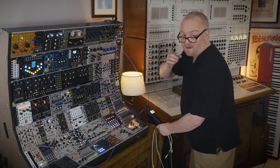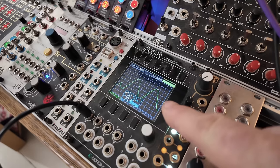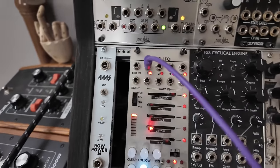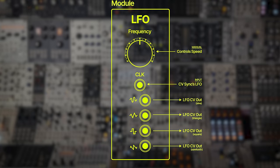We've plugged that into the speakers just like we had with the other oscillator, but you'll see that it's going incredibly slowly — too slow for us to hear. So this oscillator is actually called an LFO, which stands for Low Frequency Oscillator. It works very similar to a VCO but just a lot slower. This dial controls the speed, whilst this CV input resets the oscillator cycle when it receives a trigger input — we'll return to triggers in a moment. Here again are the different waveforms, but remember they're a lot slower than with a VCO.